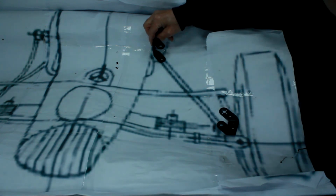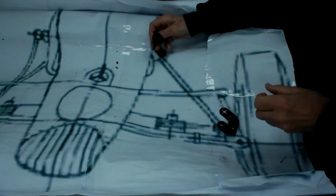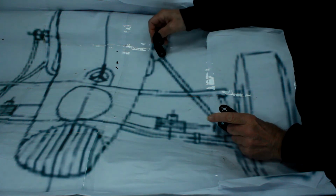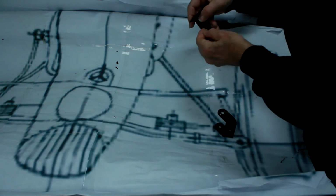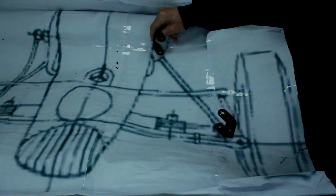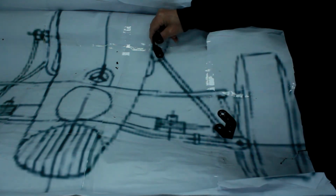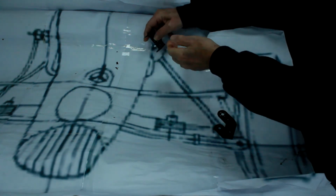And I got these because they were ideally shaped. They're 45 degrees. I can bolt them to the chassis frame there and bolt them to the back of the yoke at the end of the axle with the carriers for the kingpins. And my thoughts were that if I was going to put it like a Heim joint top and bottom with a pair of radius rods, and the thought is that if they are not man enough in taking that load, there's 2 things I can do.